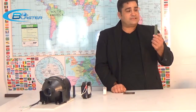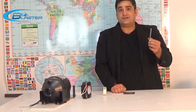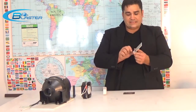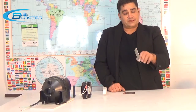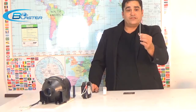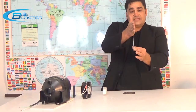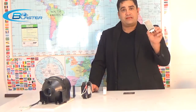Ceramic, on the other hand, is the same as porcelain, and this high-quality porcelain ceramic has a 2,000-degree temperature rating before it can ever melt through. On one side we have nickel-titanium printed on and soldered into the card so it can be changed easily from the ozone generator cell. On the back side, we have an electrified foil with a ceramic coating over top. So we have two electrified medias, with the dielectric being ceramic rather than air. These plates have a 3,000-hour lifetime and work really well.